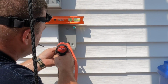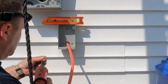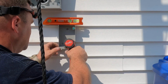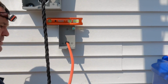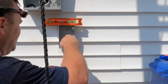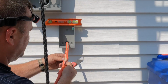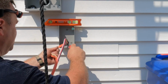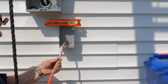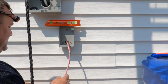I like to use these 2.5 corrosion resistant Phillips head screws, exterior screws. The galvanized, and that's what I use outside. I also have stainless steel on my truck, but I don't think that's necessary here. But the closer I get to the Atlantic Ocean and the lagoons in the town that I live in here in Point Pleasant, we'll have to use more stainless steel rather than the corrosion resistant, just to safeguard from the salty air. It wreaks havoc in shore towns.